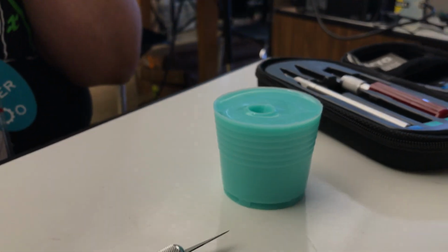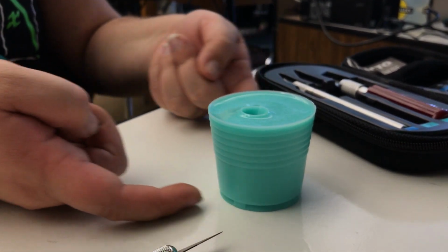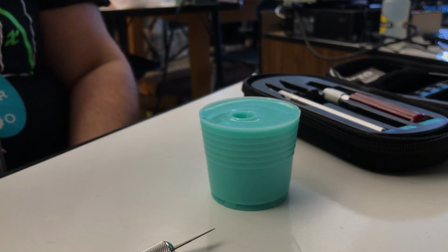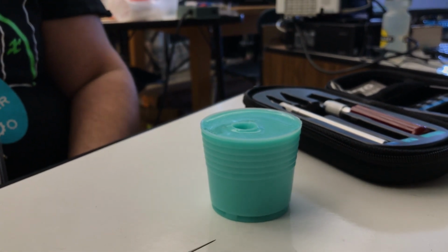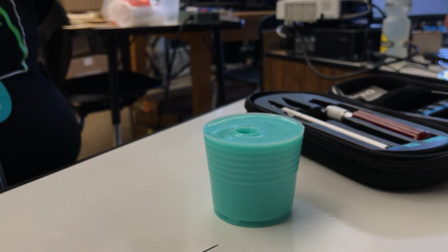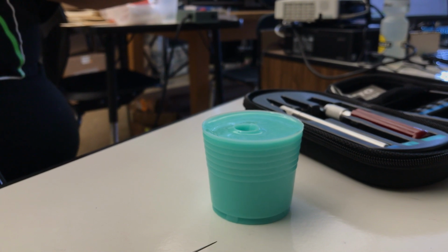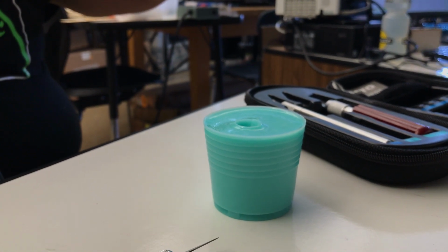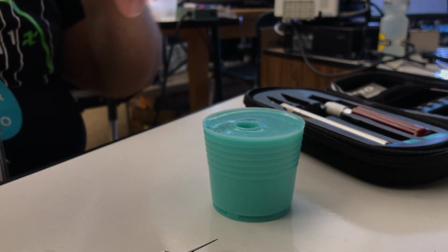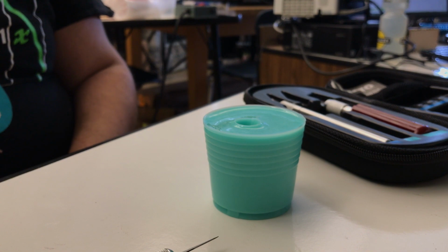Yes? Cut on both sides halfway down. Okay, halfway down, but try and leave the bottom all the way connected. That is absolutely a known and good way to go about it. What else? Zigzags, right? If you do something kind of like this, you'll be able to see exactly how the mold should go back together. Anybody else? You can cut the inside of it only, and then you can just grab it out. The outside will still be attached, then you can just take out the plastic.